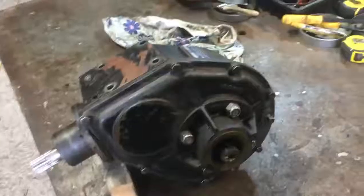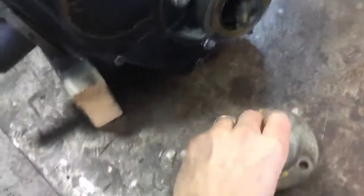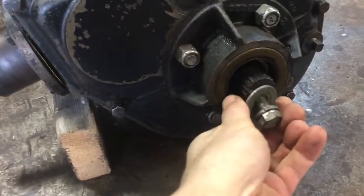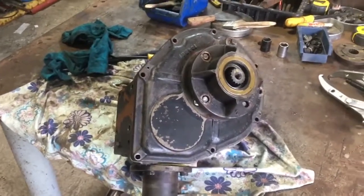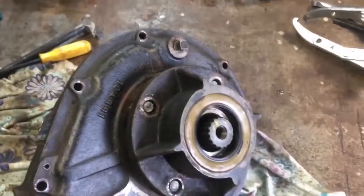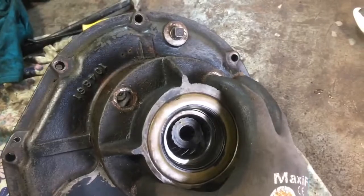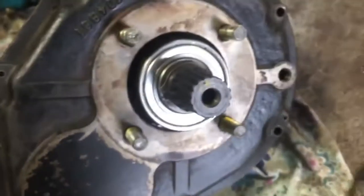I should note that the splined shaft is not what drives the inner yoke of the half shaft — there are these flanged splined pieces fitted on and retained by a center bolt into the threaded center. Those are already removed and cleaned up. I took this, unbolted the flange, then pulled it using a gear puller to push it off of the center axle. The outer bearing here — housed in the inner shoulder — is a 6207Z shielded, one a Japanese NTN, the other a Nachi. Good bearings were fitted.